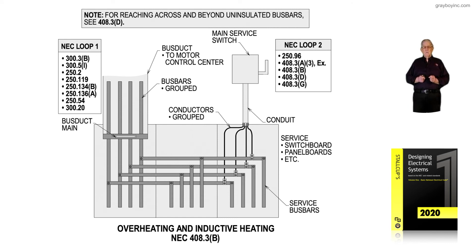Figure 7-1 deals with overheating and inductive heating due to magnetic fields creating induction into the metal and causing insulation to overheat if these magnetic fields are not canceled out. As you read loop 1 and loop 2 and take time to study them, you'll have a better understanding of exactly what NEC 408.3B is asking the installer, designer, and contractor to do — from the design stage, to bidding the work, to the electrician making the installation.